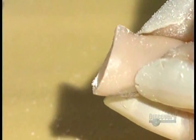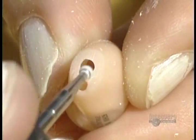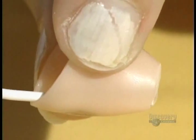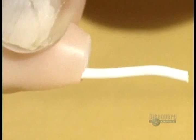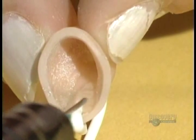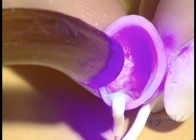A hearing aid must be very discreet, so they cut the excess with a diamond disc and remove any roughness with fine sandpaper. The holes seen here are used to vent air from the earphone. A silicone tube is used to make the vent, and acrylic is poured onto the tube to form a tunnel. Ultraviolet light is used to harden the acrylic.